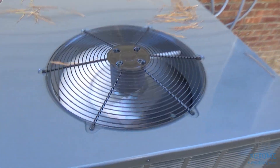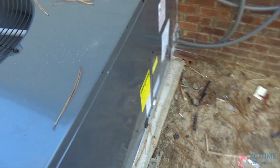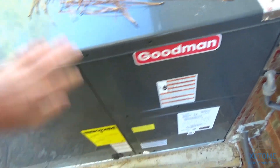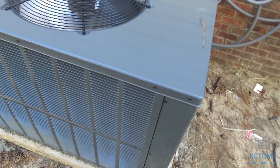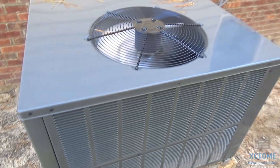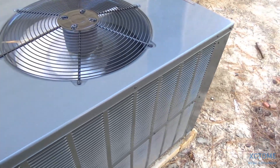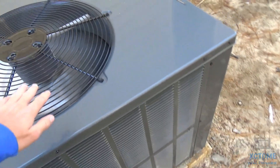Alright, it's heating — a little cold — and the blower's not whistling because yesterday I still had the carpet over some of the supply vents that was blocking airflow. That's why the blower motor was pulling hard, and that's why it was whistling and not blowing evenly.